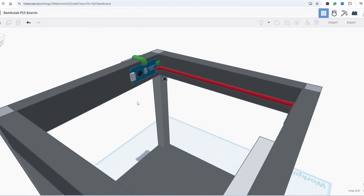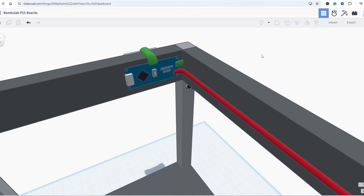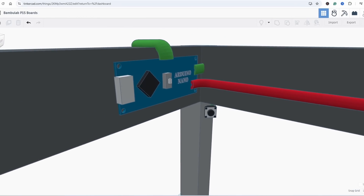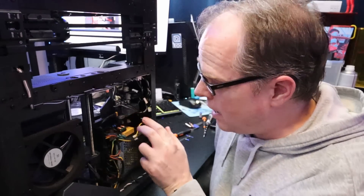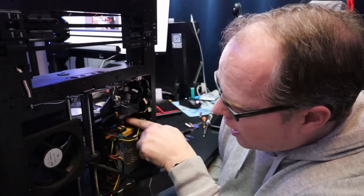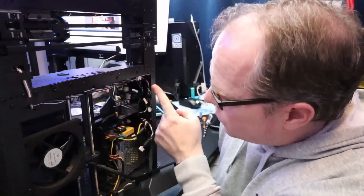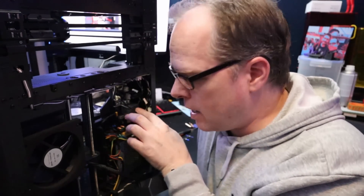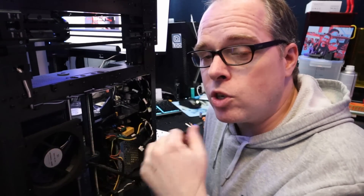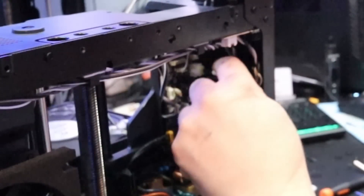If you want to do upgrades, you have to work around the fact that everything has a parent board and daughter boards. On the bottom we have the connectors: the first one is for the Z motor — just one stepper motor — with the rest done by belts on the bottom of the printer. On the other side is the connector for the right motor, and then on the other side of the cooling fins — which cool down the drivers — there's the connector for the left stepper motor, which together with the other motor controls the X and Y motion for this CoreXY system.